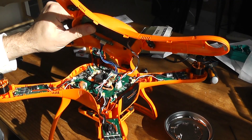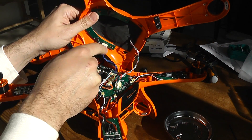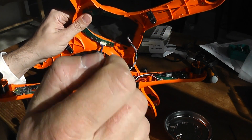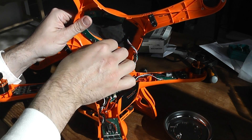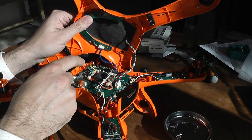Once you open it, you have two connectors blocking the GPS module. This is the GPS module, so you can gently remove this connector. Or if you prefer, you can directly tape the EMI paper without removing it, but I think it's easier to access with it removed.